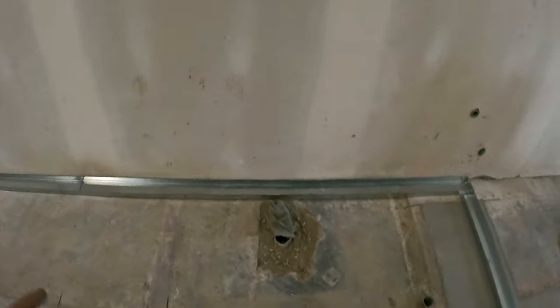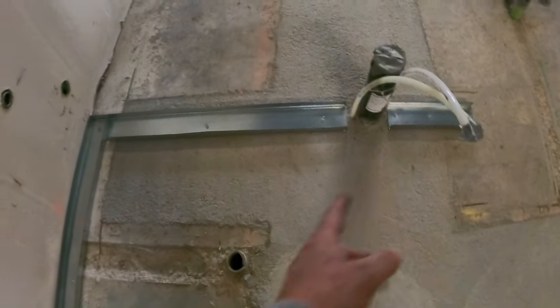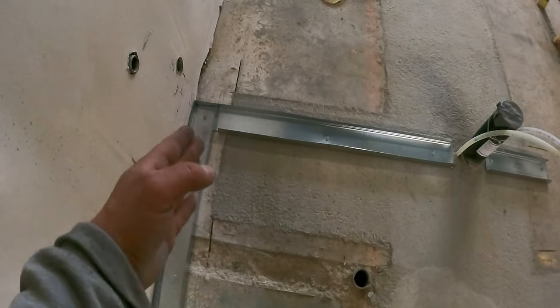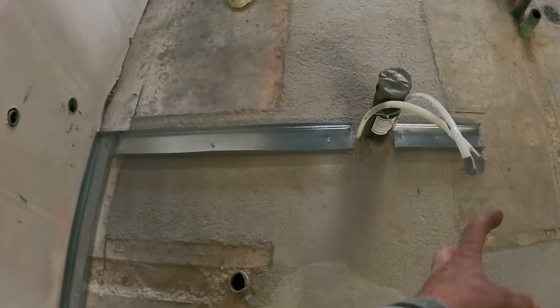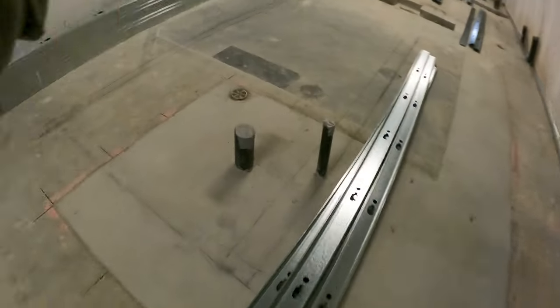You can see I go 16, 32, 48 — I got my corners overlapping, same as light gauge. I'm coming off here 16-and-a-half, 32-and-a-half, 48-and-a-half, so when the drywall goes in, locks the floater, I can put a full sheet and then a piece. This is just 16s all the way — we're gonna do the bathrooms.